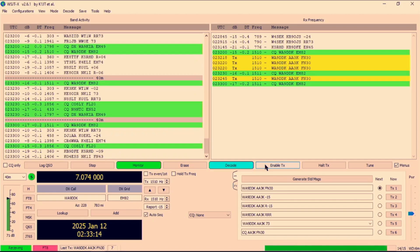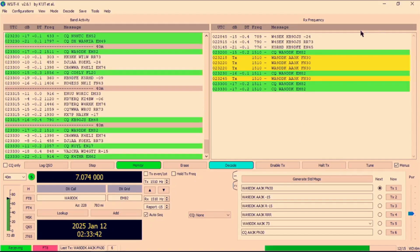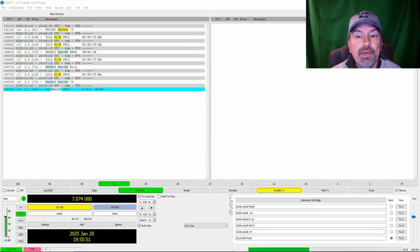And nothing. Okay, now there you have it. FT8 on a Yaesu FT-817. The same procedure will work with the ND variation of the radio as well as the 818 and the 818ND. The very nice thing about the Digirig interface, it lets you very easily add sound card capabilities to older radios that lack them. Just a couple more things for setting up WSJT-X along with your FT-817, 818.